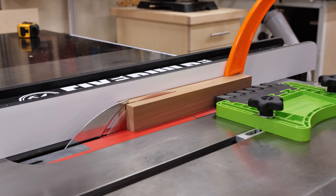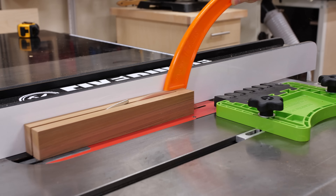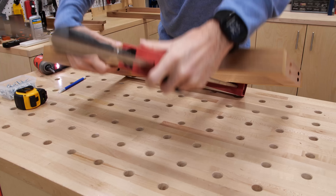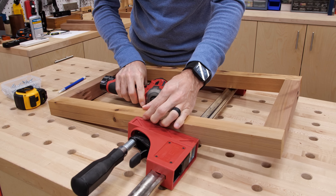The center shelf is held in place by two small supports in the middle. I ripped an extra short support in half to make those two parts. I measured and marked the frame to give 10 inches of clearance on the bottom shelf and 8 inches for the middle shelf — sized to fit our shoes, with boots going down low. You can adjust these dimensions to fit your needs.